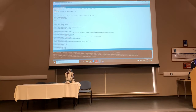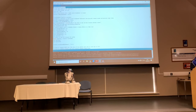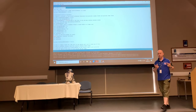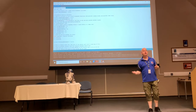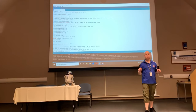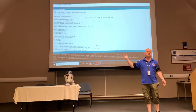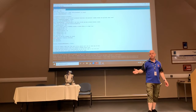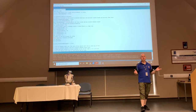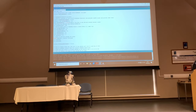Okay, let's have a look. We've got some clever stuff here, which basically says set everything to zero. All of this is pretty important, because it will get referred back to in the event of a loss of connection between your transmitter and your receiver, okay? One of the most important things that you're going to get judged on at your MOT is failsafe. You must have failsafe on your droid. What that means is if your transmitter suddenly dies, if you take the batteries out, if it gets knocked out of your hand and falls on the floor, your droid is going to stop if it was moving. The dome is also going to stop moving if it was moving already, okay? The last thing you want is to lose connection and then for your droid to run off into the distance. Fortunately, the touchscreen code's pretty good at handling that.